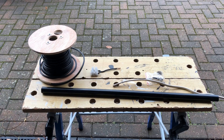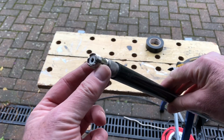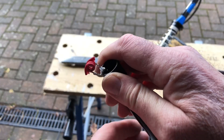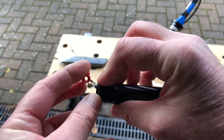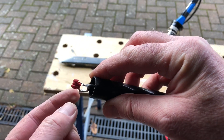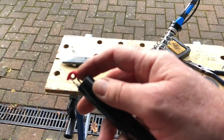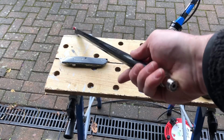I've got the PL-259 in one end — it neatly fits with a female. Now just to wind the coil and attach it to this end. It's not the neatest job, but there's the coil. The insulation started pulling away once I heated up the copper end, but it's still not touching. I'll just tidy this end up a bit, add the PL at that end, and then you've got a sniffing wand. That's the theory anyway — hopefully it works as good as the loop.